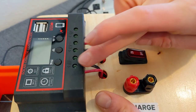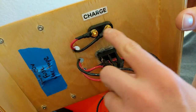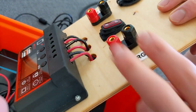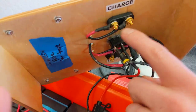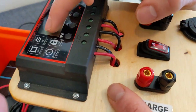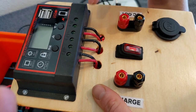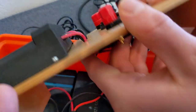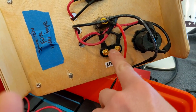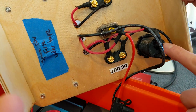The positive and negative wires for the solar charging come through and connect to the charging ports. When you plug the two prongs in, it'll go through the banana jacks, through the wires, and into the solar charge controller. The load positive and negative come out and are daisy chained into the DC out banana jack and also into the cigarette port.